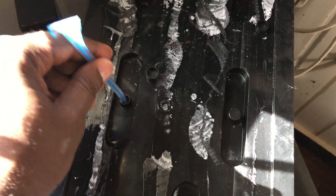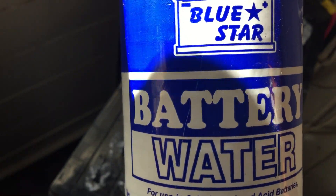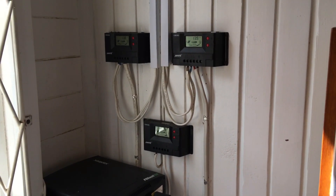So I made a little straw to fit into these holes, and what I'm doing right now is simply adding deionized water. I purchased liter-sized bottles of deionized water, and I'm refilling each cell with about three-quarters of a liter of water. Then I'm going to seal it shut again, just as it was before, using epoxy to glue the cover back on. That is going to restore the life of the battery — possibly not to 100%, but definitely up to about 90% of its previous charging capacity, and it will probably extend the life of the system for another two to three years.